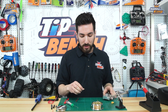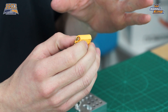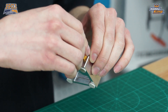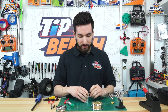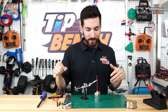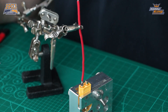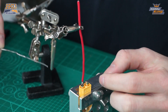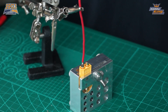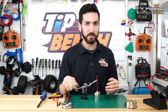Now that the wire is tinned, we can prep the connector. As mentioned, we're using the XT60s in a pair so heat can be drawn away by the other connector, preventing melted bullets or plastic housings. We'll use the clamp side of the Mr. Jig to hold the XT60 — slide it in and clamp it down. I've turned the Mr. Jig vertically since it makes it easier to see and solder versus horizontally. The setup has our tinned wire inside the connector. I'll heat the wire with the iron, and as it gets hot the solder will flow into the connector — filling it up around the wire.